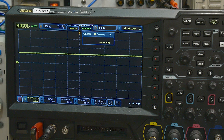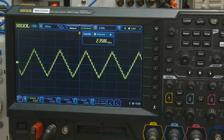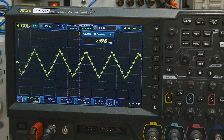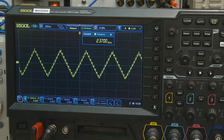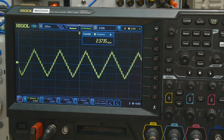I changed the wrong wire. I think I destroyed my chip. I put plus five on pin 2, which is ground. Oh well, at least you got to see it before I destroyed it. These chips are hard to find. Let me recycle the power and see if it comes back... I don't think it will. I think I fried something.